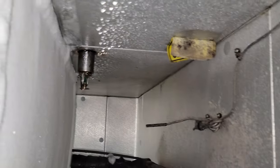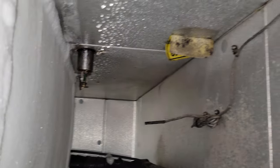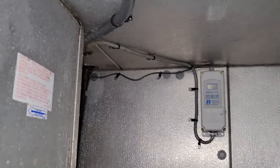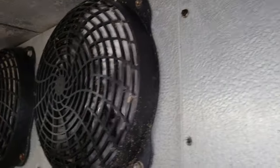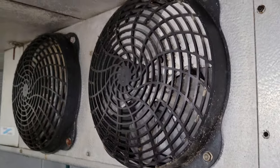Look at the fire sprinkler placement on this one — it's in a ridiculously horrible place. The process here: turn off the power. This one has a utility switch right here. Take the covers off, take the fan guards off, start defrosting, and then we'll figure out what caused the ice-up.